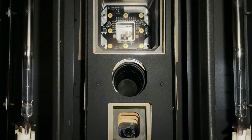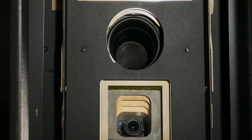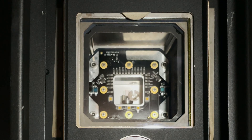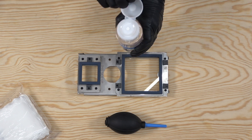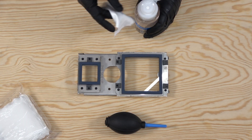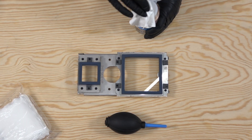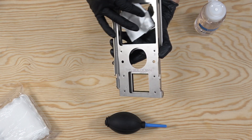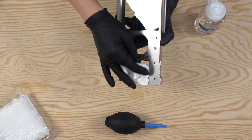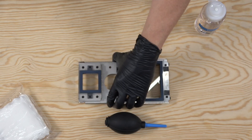The smaller window located at the front of the optical cassette protects the camera lens, and the larger window at the back protects the upper laser window. To clean the optical cassette windows, wet an optical cleaning cloth found in your maintenance materials box with denatured ethyl alcohol and wipe the surface of the glass. Do not dispense the ethyl alcohol directly onto the glass or touch the glass with anything but the optical cleaning cloth.